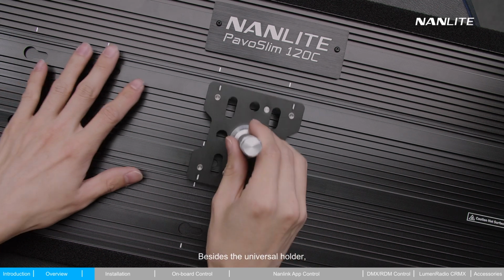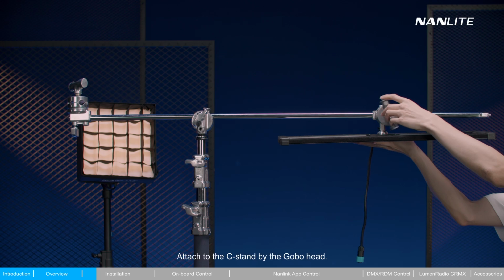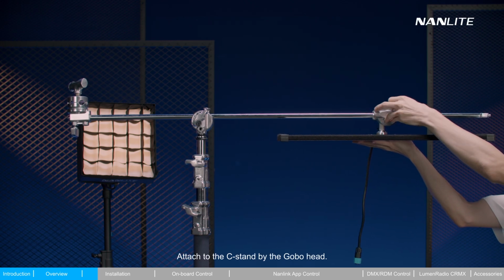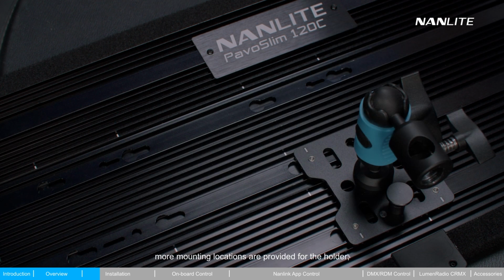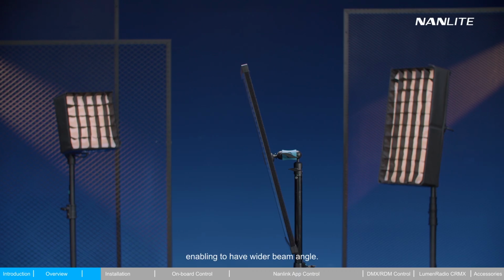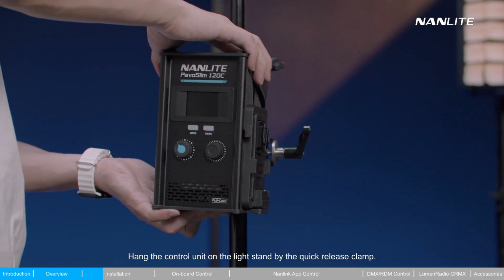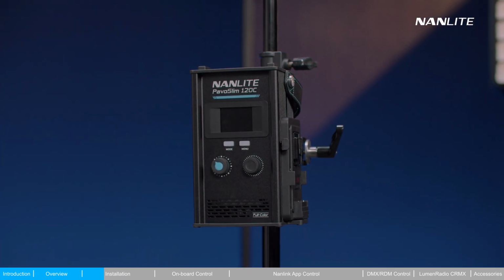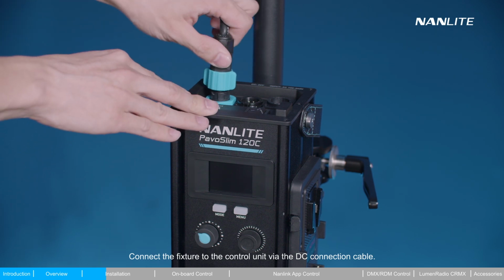Besides the universal holder, you can use the included baby pin holder. Attach to the C-stand by the gobo head. With multiple sockets, more mounting locations are provided for the holder, enabling a wider beam angle. Hang the control unit on the light stand by the quick release clamp. Connect the fixture to the control unit via the DC connection cable.